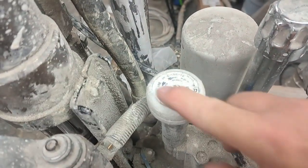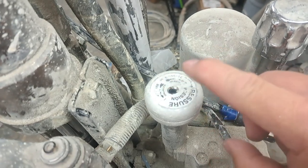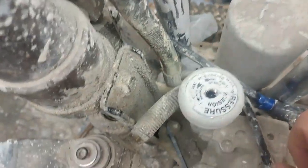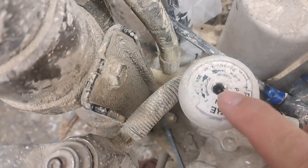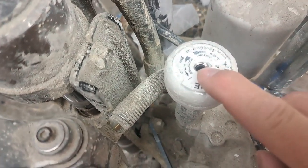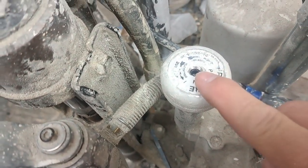This is your pressure control. There's a sticker that usually has this hole covered up — you can just cut it out so you can see it. On the inside is going to be an Allen screw. You're going to take that Allen screw all the way out. That's a set screw. You're going to take it all the way out of the cap.